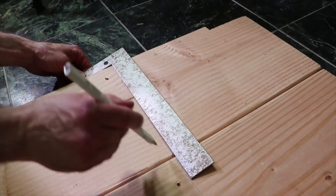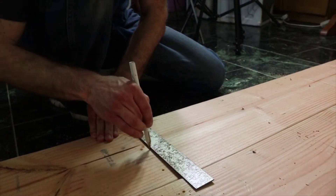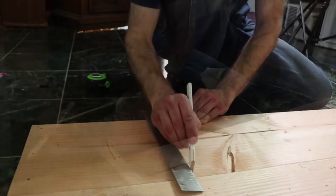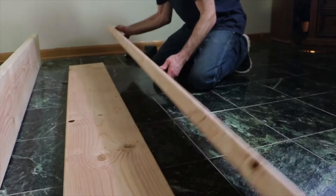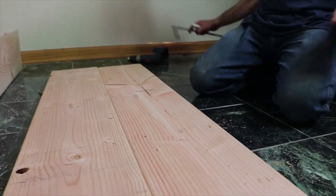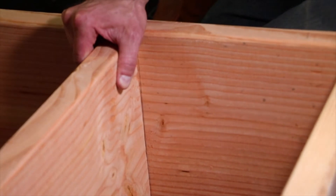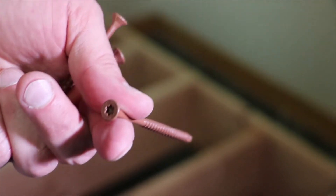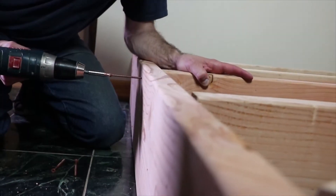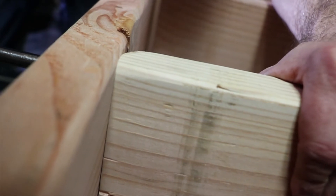Now I need to draw the same lines all the way across as I did on the first board. I'm drawing the line on the inside of each piece by lining up my boards next to each other and using board number one to make an exact mark on board number two. We now use the guidelines to place each of the shelves, using three and a half inch length screws. By drilling the pilot holes, the screw is going to pull each shelf tight up against the end.